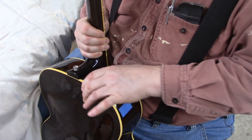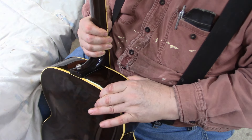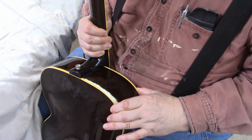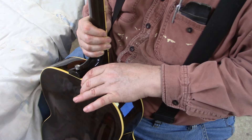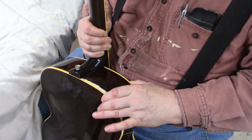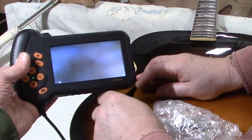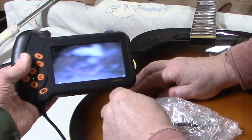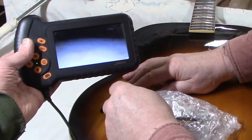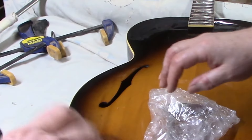We've tried using suction cups and other methods, but pumping seems to be as good or better than any other approach. When it's a loose joint like that it can be hard to get glue in with a crack if it's tight and not separated. Using the scope we can see the glue right there — and that's right at the top of the kerfing, which is right where I'd expect it.